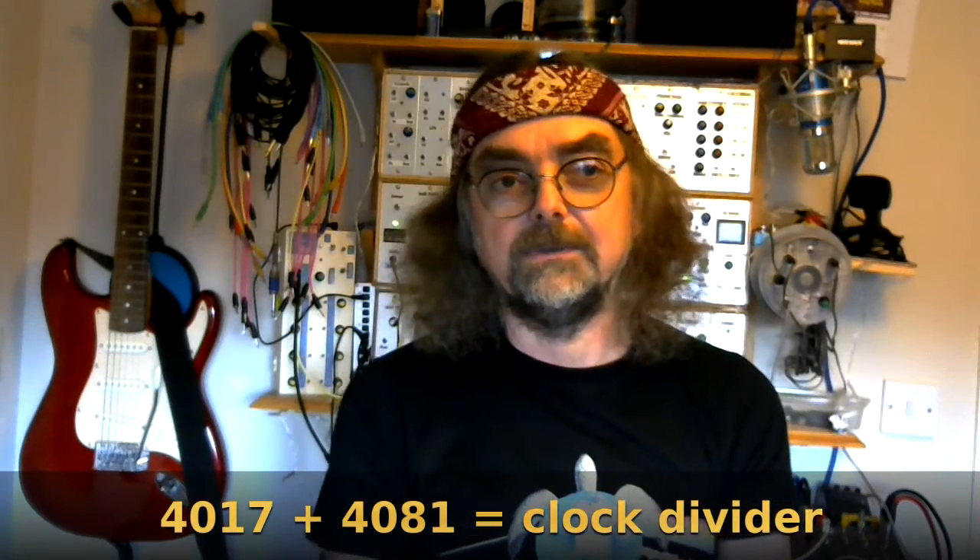Welcome back to the Cozzy Sound Channel. I recently found a little bit of time to revisit my simple clock divider. If you've been following the previous videos, you'll know that this is based on a 4017 decade counter and has a rotary switch that changes the reset point, which changes the number of counts before you get the next output. I've also been playing around with incorporating an AND gate into the circuit, because this helps match the timing and also the shape of the trigger pulse to the output pulse. With the 4017, it'll hold its pulse open until the next count, so it's more of a gate — if you hit it with a trigger input, the output is a gate.